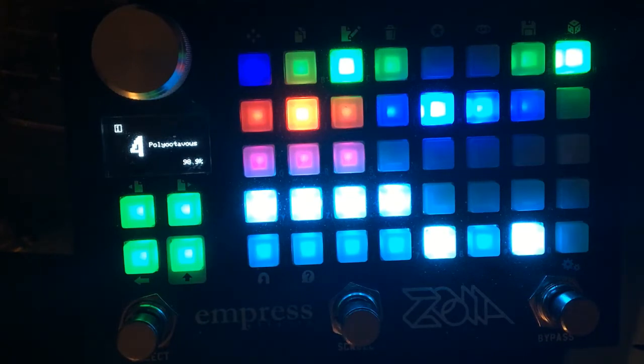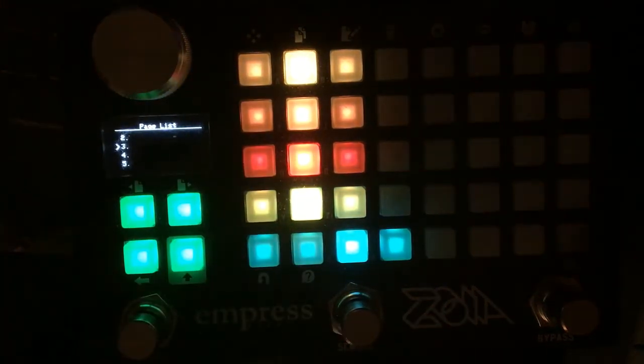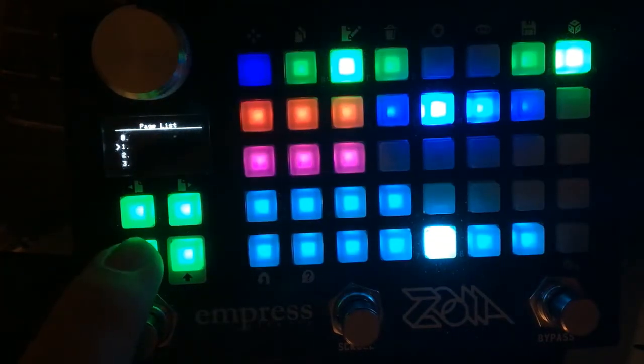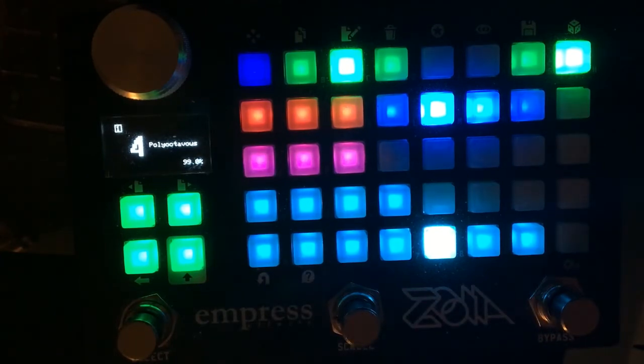I want to talk about this approach to volume swells and envelope triggering. Normally I advocate for envelope followers because I find onset detectors very finicky, but this is a case where I think onset detectors work well. This patch is pretty basic — if you go into the guts of it, these are the pitch shifting modules, these VCAs are the mixer, and this is the high pass filter that precedes the pitch shifting. It was a late addition so it comes in a weird place. They all go to this VCA where they're joined together so they can be affected by a single envelope, and that goes to the low pass filter and then out. This is a mono patch, left to left.